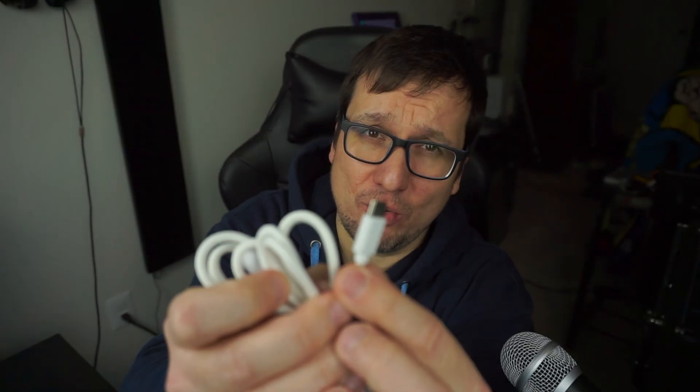Then you're going to need a cable that works with your PCB. Most PCBs these days use a USB-A to USB-C cable, and if one didn't come with your keyboard, if you have one you use to charge your phone or your mouse, that's going to work as well, provided data can come through it. Then the last thing you're going to need is a set of tweezers — this is just from my iFixit kit, I'll link that down below. You're going to use these to actuate the hot swap socket and simulate pressing a key switch without needing to insert a switch, which would defeat the purpose of testing.